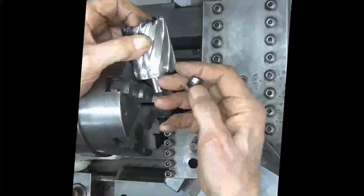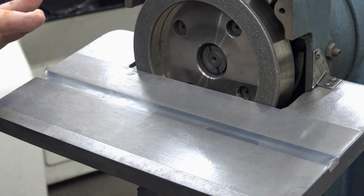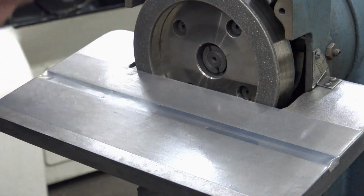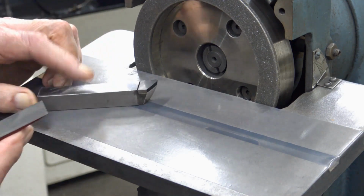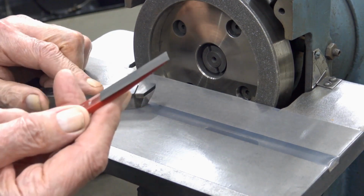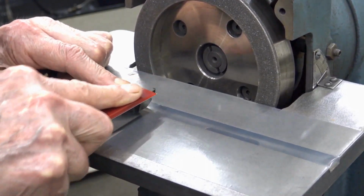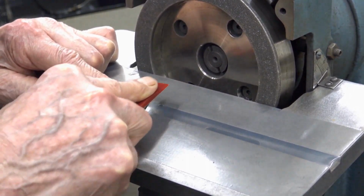I hope you can see this, because I can't see in that camera. All right. I've already done this in a previous video, made it public. Looked at it a number of times, and I didn't like what I saw. This grinder was all dirty. It looked like a toilet that had never been flushed. I'm going to do it again here. Here's a tool bit. I'm going to grind it, and here's the technique. Like before, this is the diamond file. This is the top of the carbide. I'm going to file the top or stone the top, whatever terminology you want to use.